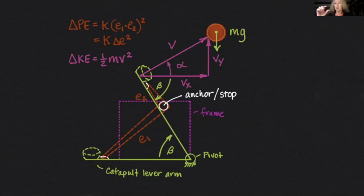That change in potential energy is going to get converted into kinetic energy of this projectile. Kinetic energy is roughly one half mv². Now, to be honest, we've got a lot going on with our catapults — we are moving this lever arm, there might be a little friction with how I duct-tape my lever arm in there — so it may be more complicated than I'm explaining. But I'm an engineer, no worries. I'm going to make an assumption and see what insights I can get from simplifying my problem. All I care about is the velocity that's transferred into this projectile. And I can do some tests to figure out if I'm in the ballpark and if what I'm assuming makes sense.